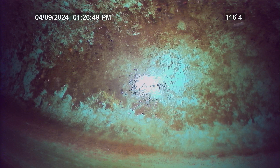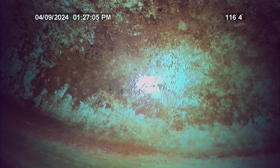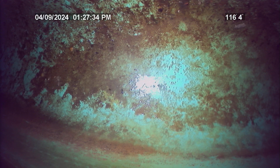The tap of the city main is approximately 116 feet from the entry point in the downstairs utility room. The sewer lateral at this residence is all PVC with one issue found during the time of inspection: a failed joint at approximately 56 feet in the SDR 35 PVC, in need of repair. This failed joint has root intrusion in it. The spot was located in the front yard with green utility marking paint and a green utility marking flag at approximately 8 feet 4 inches deep. These locates are for inspection purposes only and the line must be relocated prior to any excavation being done to make the proper repairs.